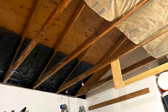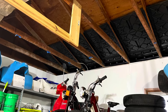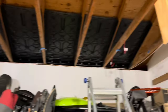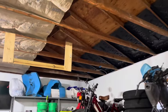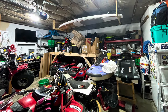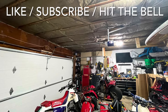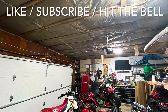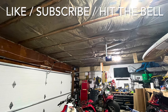This project did end up taking three days to complete. Probably could have got it done in two days, but clearing the garage to work every day took quite a bit of time. A couple of tips and tricks I learned along the way: stair-step the edges for the eaves; use a board to press down when making cuts so you only need a couple of passes; every other bag of batts, switch out your razor blades; and as a backup, if you mangle a piece, just use cardboard to strap it down. And that's a wrap — the project is complete! Can't wait to turn the heat on to see how fast the place heats up. If you like the video please leave it a like and subscribe to Two Acres. Appreciate you watching.